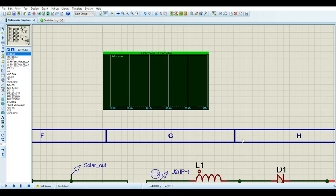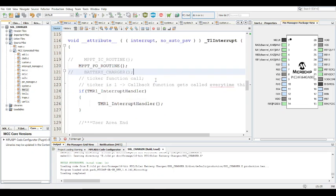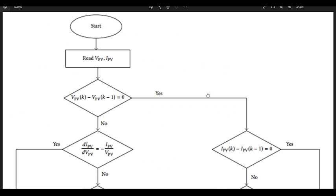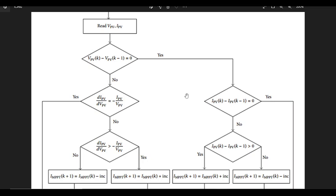Right, so this side is going to take a while. And yeah, that's that for a solar battery charger. Like I said, it could be done on one converter. Obviously, that's great efficiency wise and everything. I find it's easier to do on one converter if the converter is a boost converter than if it's a buck.